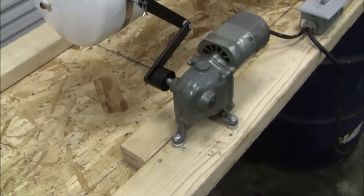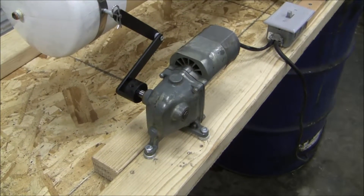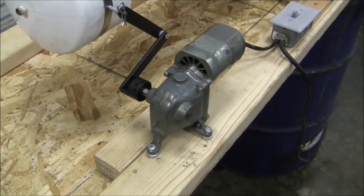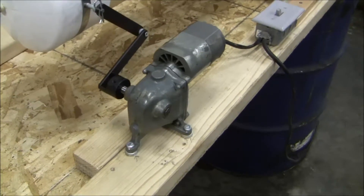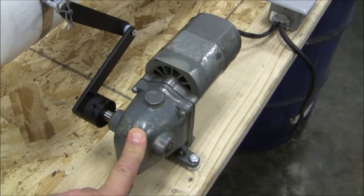The agitation works through this device right here. This is a gear reduction motor with a 90-degree output shaft, and it turns at 8 RPM. In the Grainger catalog this is over $200 — it's a very expensive item. I would not have gone out and bought this.